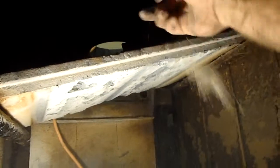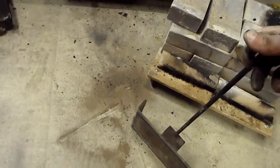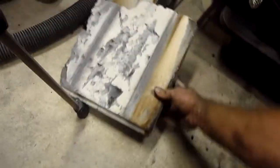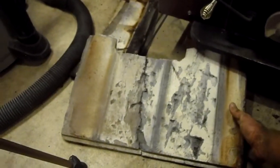This is definitely a video for cleaning purposes, so it is what it is. I'm not going to say it's something that it's not. So at some point, depending, oops, there we go. Two things just happened. Number one, I got the stove damper plate out. This is what stops the smoke and the flames from leaving directly at the firebox and forces it to go through the channel of the stove. The other thing you may have noticed is that in the process of putting all that weight onto that board and pressuring it, I've actually broken it. This is supposed to be a single piece. I did break it, which is not a problem because I'm already planning on replacing it.